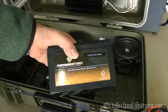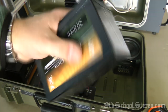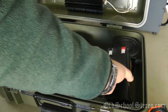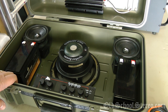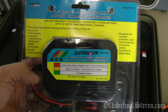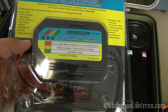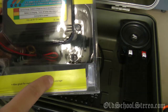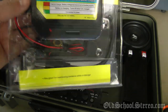Since I wanted this unit to be completely portable, I'm going with two 12-volt, 8 amp-hour sealed lead-acid batteries, which can be mounted in any orientation — up, down, sideways, upside down. Two of these should give the Punch 45 a nice running time, probably a couple hours or a little more. To keep the batteries charged, I've got a battery tender trickle charger from Harbor Freight — about ten dollars — and I'm planning to mount it inside the enclosure with a female power plug so I can just plug it straight into the wall.